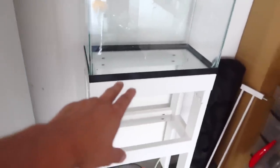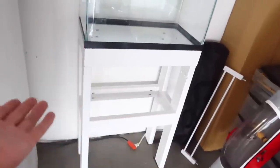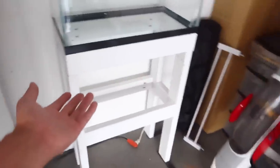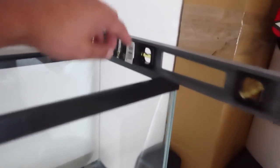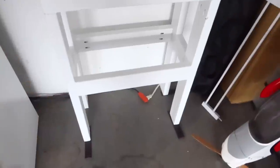It's done, it's complete. We got a total of three coats of paint — I felt two would have been okay, but with the third one it really sealed everything up. More importantly, if water ever does get on it, which it probably will since it's an aquarium right above it, it's pretty well protected. And again, if it did get damaged, it cost me about $15 of material. I made sure it's nice and leveled both front to back and right to left using shims — it took three shims to get it perfectly level, because even if you cut everything perfect, this concrete slab isn't perfectly level.